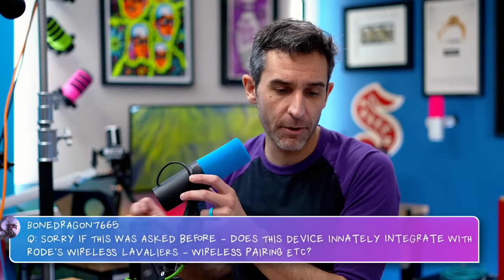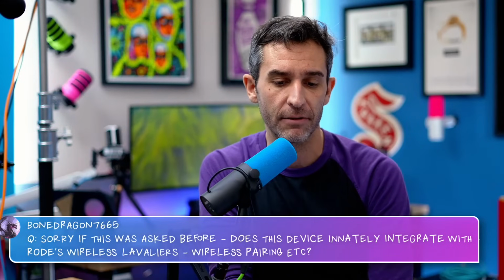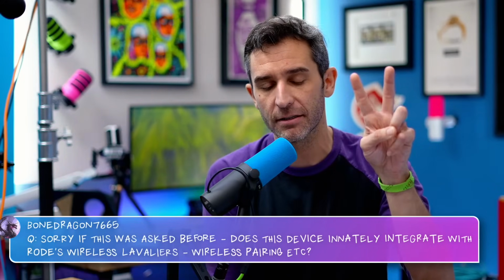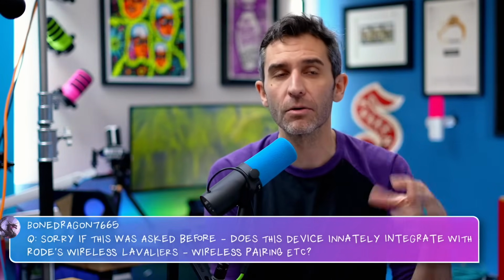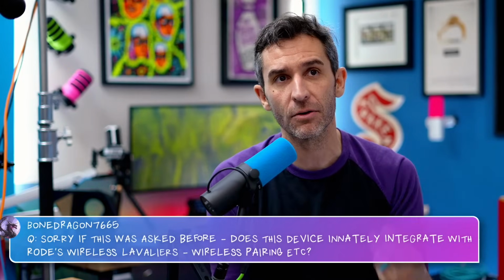It's a great question. Bone Dragon asks, will this device innately integrate with Rode's wireless lavaliers? Yes, there's 2 receivers built into the video, so you can do what Rode calls their 4th generation devices. That's the Wireless Me, the Wireless Go 2, Wireless Pros, Interview Pro, all that stuff. Basically, any of their wireless things from the last 2.5 years will pair directly to this. You don't need the receiver. There's two receivers built inside. You do need the transmitter.